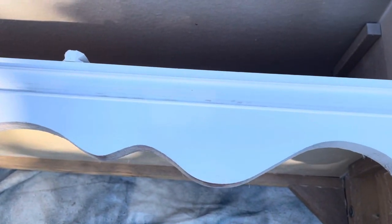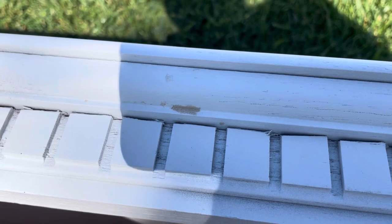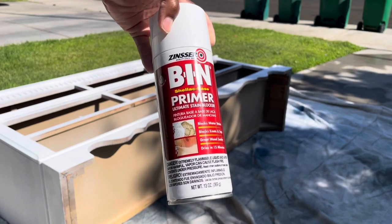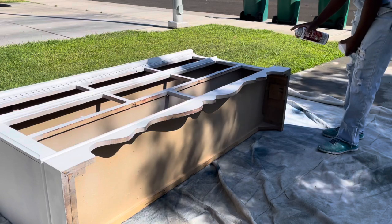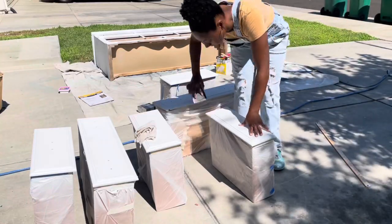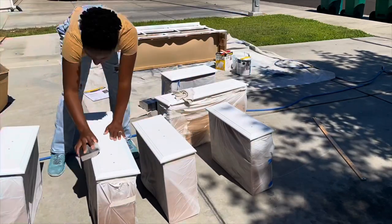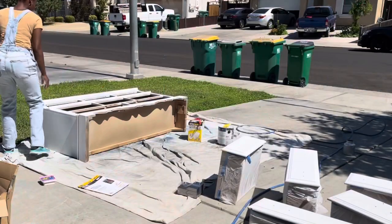Okay, so after two coats of primer, I'm noticing that I still see some wood tannins coming through, and this is kind of what they look like. If I'm wrong about this, somebody let me know down below, but this is what I believe to be tannins. They look like little brown or yellowy-ish spots that come through your primer. To fix this, a simple solution that I found is to take a spray can of the Zinsser shellac-based primer versus buying a whole gallon of it. Because it's shellac-based, I've heard really tedious stories about the cleanup process, and I don't want to deal with that, especially putting it in my spray gun. I'm not comfortable with that. The spray can actually did work for me, and that's something you can try if you have the same problem. And here I am sanding everything smooth with a 500 grit sandpaper so that I can move on to the painting process.